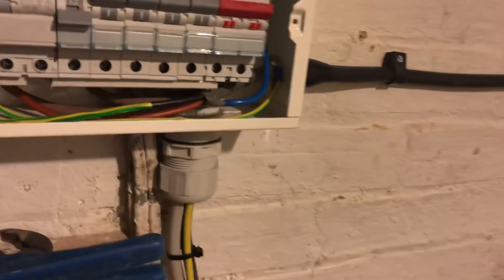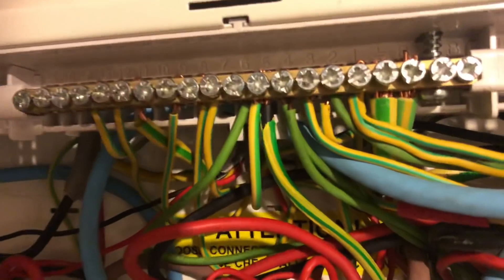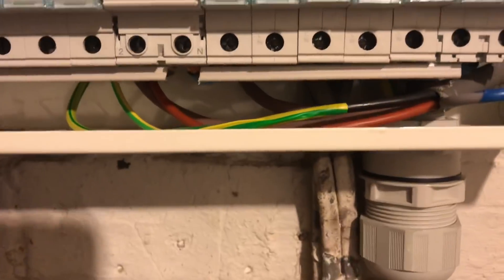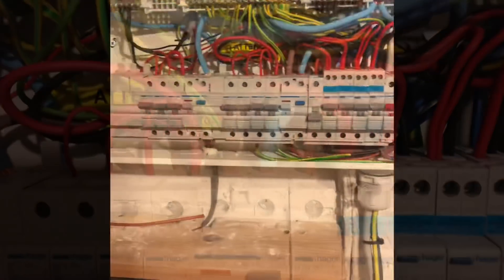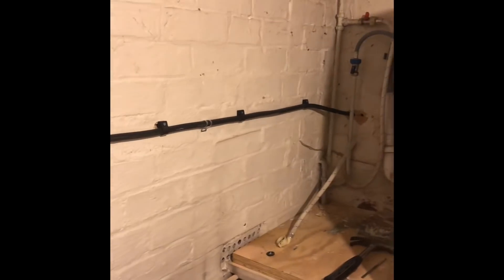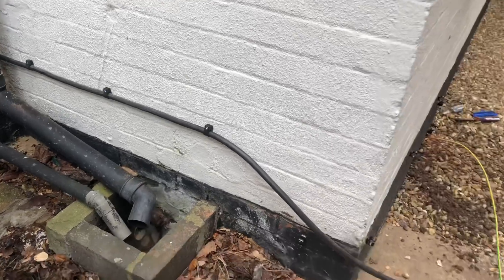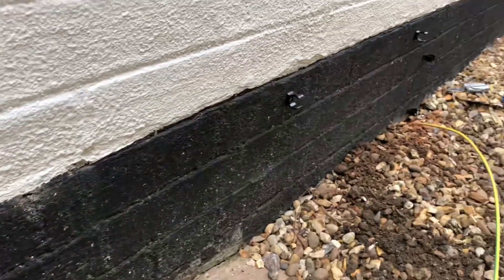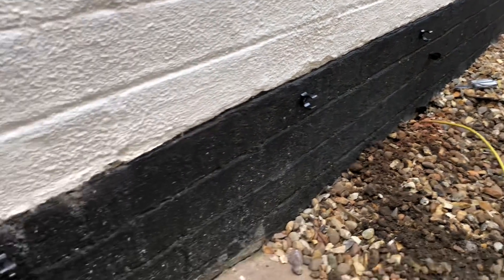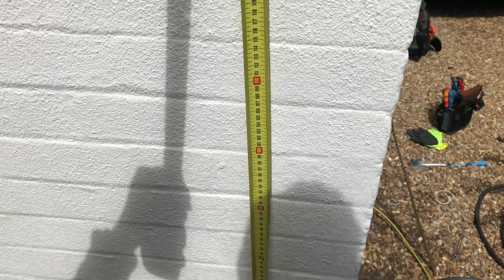It's so easy to fit these in situations where you can't turn all the power off — for example in a commercial setting where it's too risky for the customer. You can just flick it in without removing the whole bus bar. Here I'm using my torque screwdriver for the first time in real life, using the Hager torque settings recommended on their website, and managed to get the terminals tightened to just the right amount — really pleased with it. I've got my earth connections in: the earth wire within the cable and also an earth tag to the lock nut to earth the cable sheath, belt-and-braces style. Then I clipped the armour along the wall, with PVC conduit clips ready to go up.